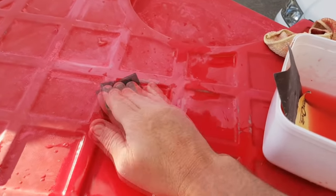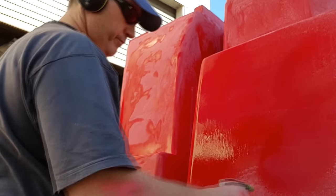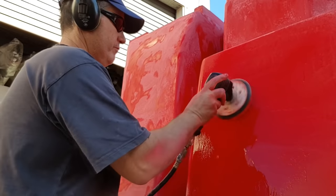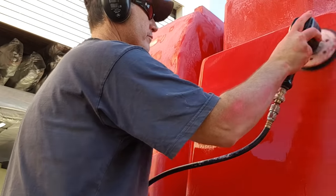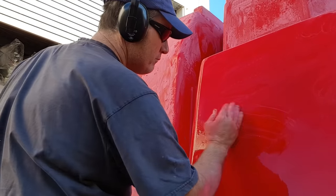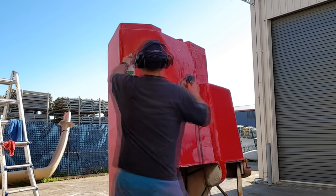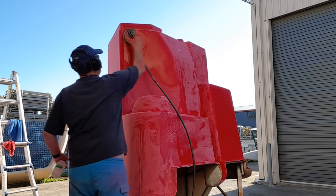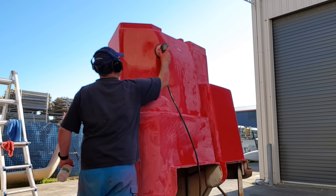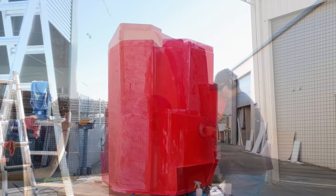to a point where I was able to give it two coats of sealer glaze, which is that TR release agent, and then another four waxes before I applied a PVA solution. I sprayed that to the top of the mold to make sure that I got good release on the intricacies of patterning. Also, you'll see a little bit further on when I get into the polishing here, I left half of it unpolished and the other half fully polished, and you can really see a stark difference between those finishes.